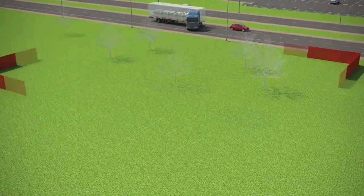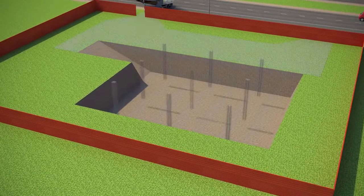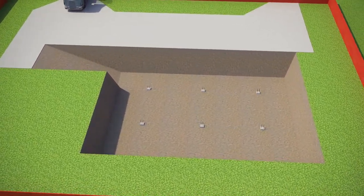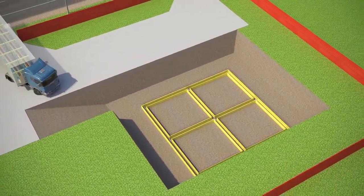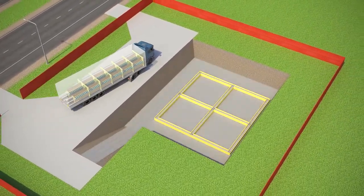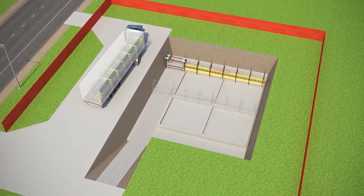The 3D printer is made up of several modules of equal length, which are equal to the distance between the building's columns. The modules consist of a slidable framework, an elevator for the cartridge cart, and rails for moving a manipulator. The modules are brought to the building site already fully assembled, which greatly simplifies and speeds up the installation, dismantling, and transportation of the printer.